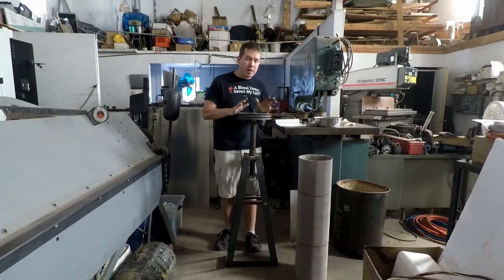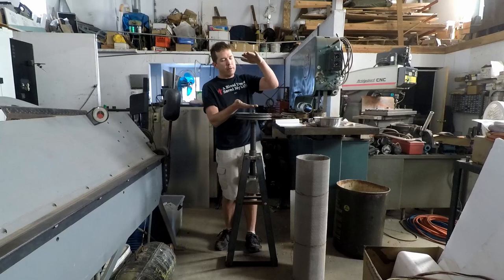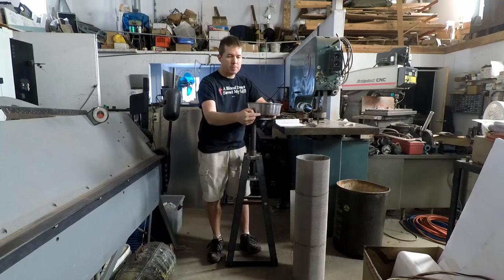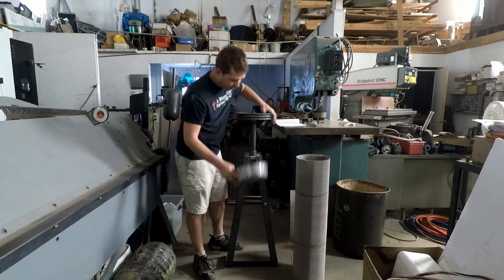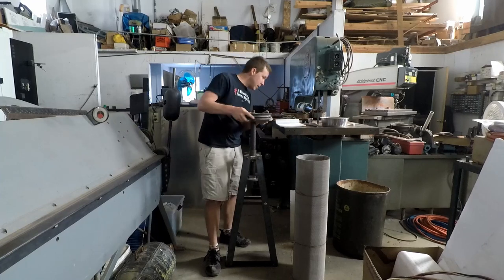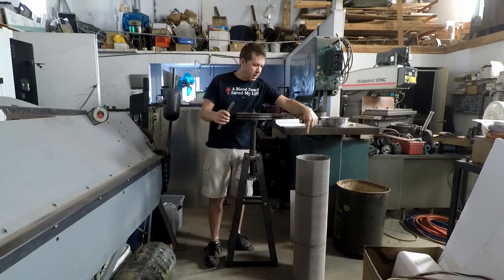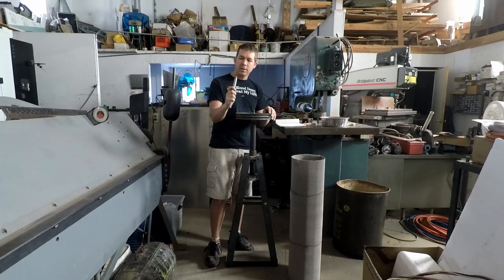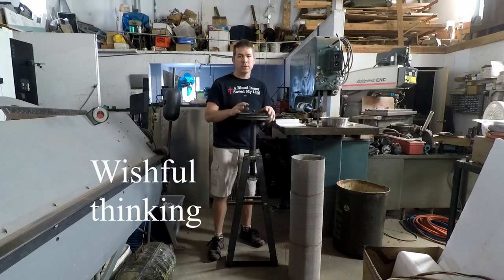Now that I've got this down and looked at it, what I need is a screen cylinder. I'm going to use this screen and make a cylinder about 6 inches in diameter and about 12 or 14 inches high. Then I'm going to put that cylinder inside a stainless steel pan, poke a hole in the side, and the juice will gather in the pan and run out. I'll also need a press plate — an aluminum disc that fits inside the screen cylinder — to press down into it. I've already got a steel rod shaft with 5/16 threaded points on it, so hopefully it'll be strong enough and won't wander. It's always nice to reuse old projects to make new ones.